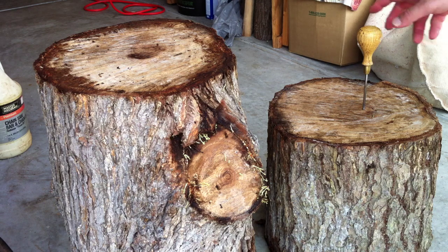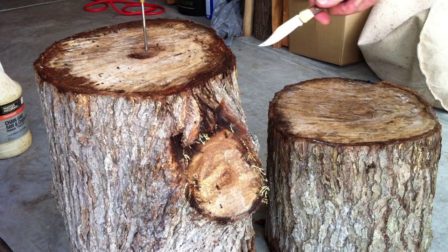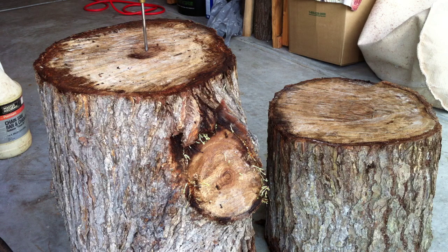This one on this side is the one I like because this is the pith. This is the center of the pith. And I got a big area here on this side that I can get a bowl blank out of. This side's fairly flat, so I think it was where the tree grew, branched off, and then maybe a couple of branches. So I get a nice bowl blank out of this side. This one, the pith is right about there, so we can get a few blanks out of each side of that. We'll cut those out of there. Overall, they didn't crack. They're still in pretty decent shape, so we're going to go ahead and get the chainsaw and cut them up into bowl blanks.